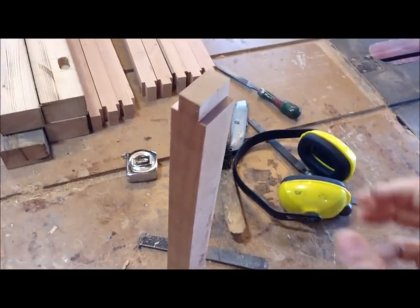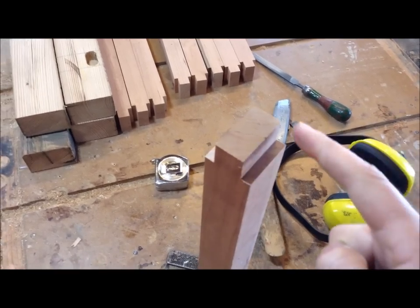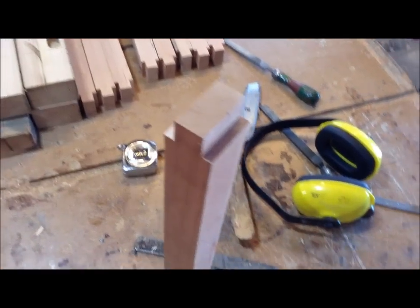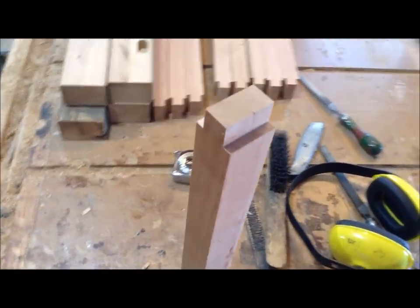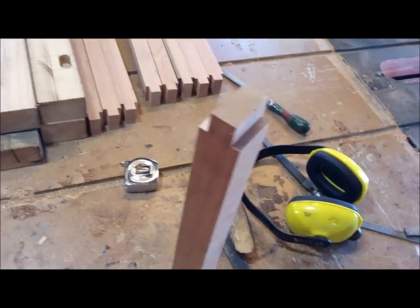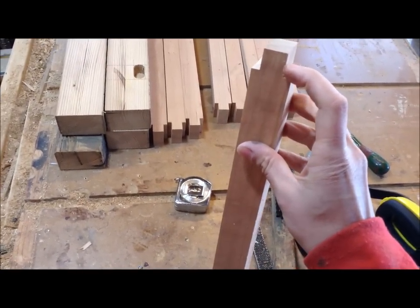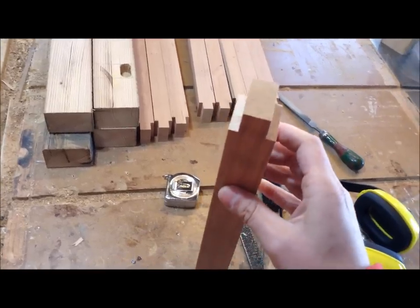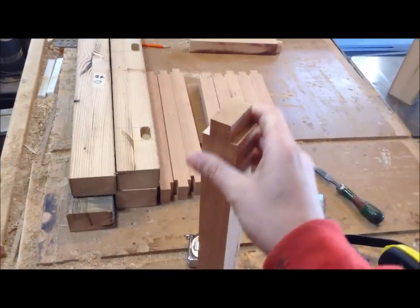That is what I did for the entire piece. Basically what I do is - when the tenon is vertical - I take a very sharp knife and take off most of the bulk of the corners. Then I take a rasp, which is a very aggressive file, and start rounding off the corners. Then with a finer file - usually right about the ends where it's hard to get to - I use that to round off the pieces until you get just about a perfect oval, and then this whole thing will fit together.